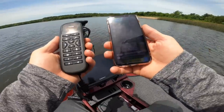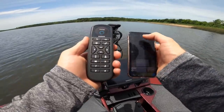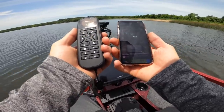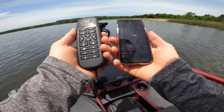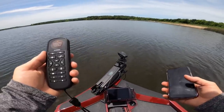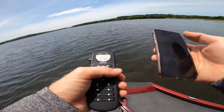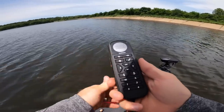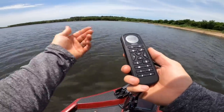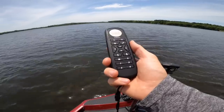Today we're going to show you how to pair your wireless remote control to your Force trolling motor — good, because I'm having issues. On the trolling motor display panel, press the power button three times to enter pairing mode. Got it. Now maybe it'll work. Select start and follow the on-screen instructions. I think we figured it out — I calibrated the remote but I didn't calibrate the actual motor. So now I'm calibrating the motor. We've got to turn the boat in full circles, keeping it level.